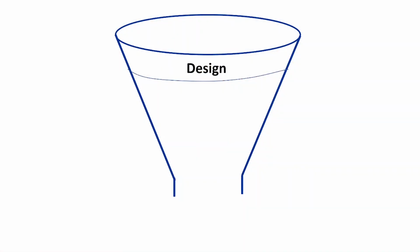The point is, depending on what design you're currently using, your marble will start in a different place at the top of the funnel and will be predisposed towards a certain sound, such as I build double-top soundboards on light but rigid sides, which have a very different starting point from, say, Australian-style lattice brace guitars with heavy and rigid back and sides, which might start over here. These different designs will predispose each towards a slightly different sound path. Maybe you use a more traditional design which will start in yet a different position and will probably sound different compared to either of these two when we finish them.